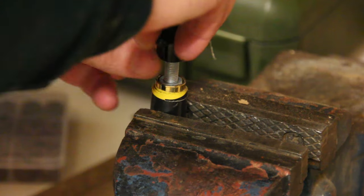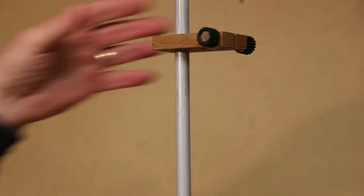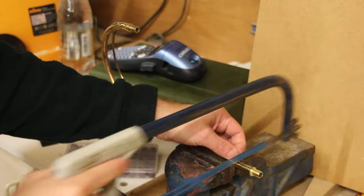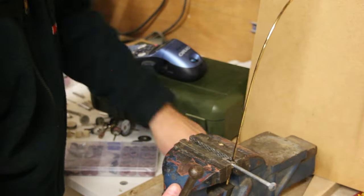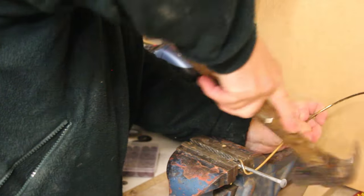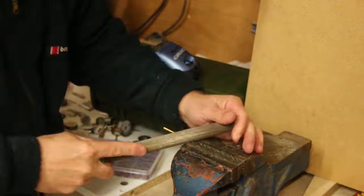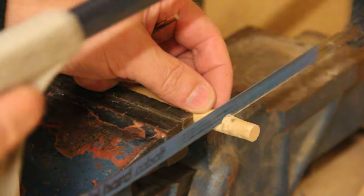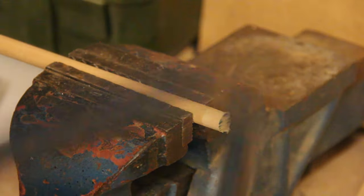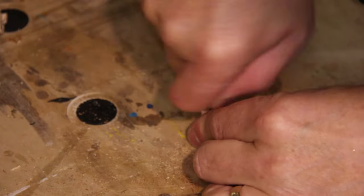This will make a bit more sense later. I'll now cut this piece off at a suitable distance. This is part of an old light fitting, but you could just use a piece of coat hanger wire. I cut and form a piece of brass into a pigtail spiral sort of shape, then sand off the cut end so there aren't any sharp edges. I cut a short piece of dowel that I've added a little conical chamfer to so that it'll fit inside the top of the tube. You won't need to do this if you're using a solid piece of wood. I then drill a hole in this dowel, fit the pigtail in the hole, and then fit the pigtail in the top of the tube.